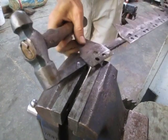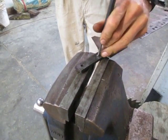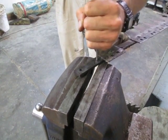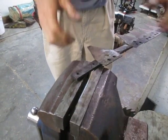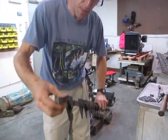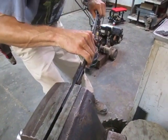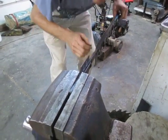Use a punch that's as close to the size of the rivet as possible - if you use one that's too small it'll jam down into the rivet and spread it out. That end was probably jammed in extra tight because of the way it was smashed in place. Now we're going to straighten out the bar - clamp it in the vise and tweak it back into shape. This strip is relatively mild steel - it's not hardened - so it will usually bend back into shape.